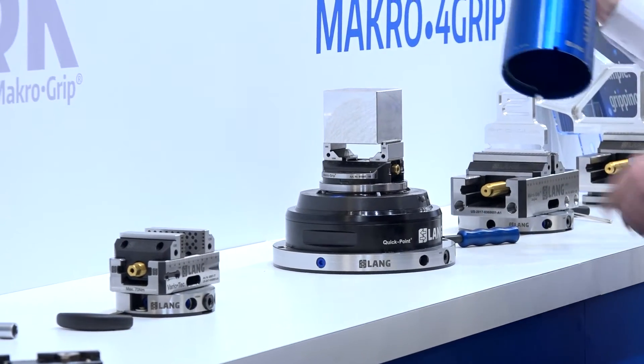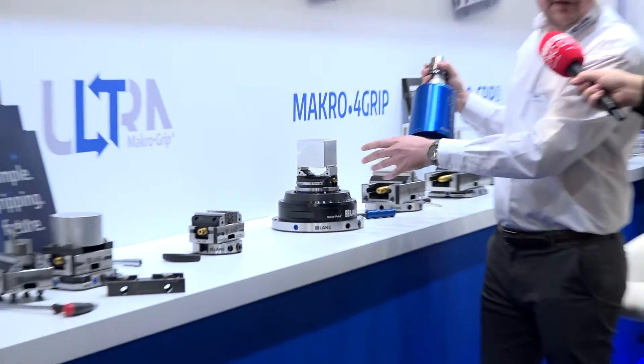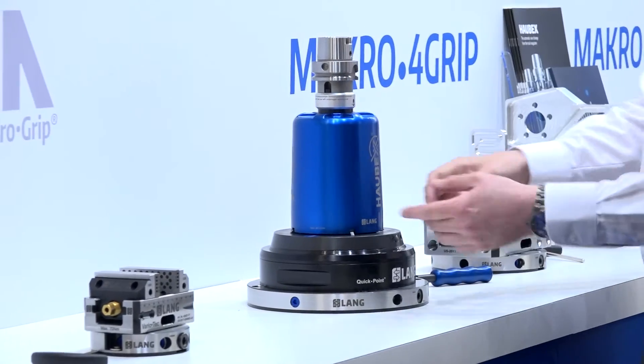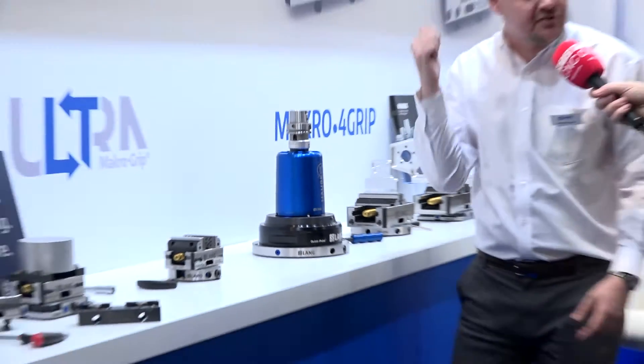So that's clamped now and ready to machine. Obviously once you've finished your operation and you want to store it back, you just bring the hood back, put it back in there, reverse the program, send that back to your tool changer.